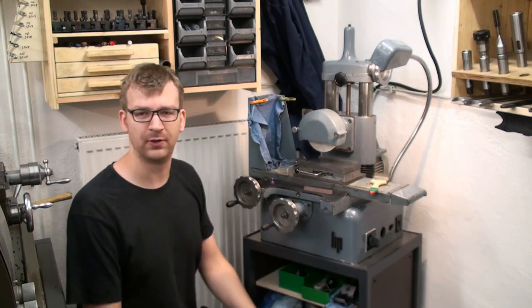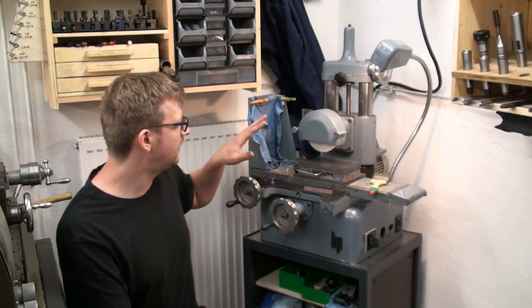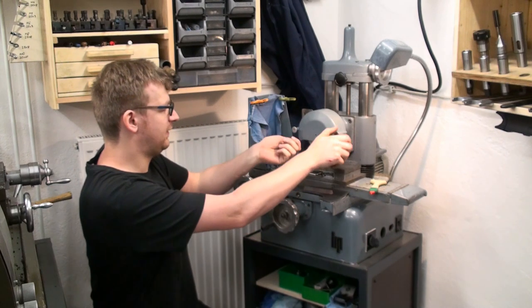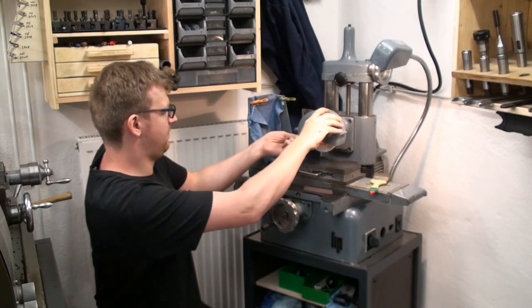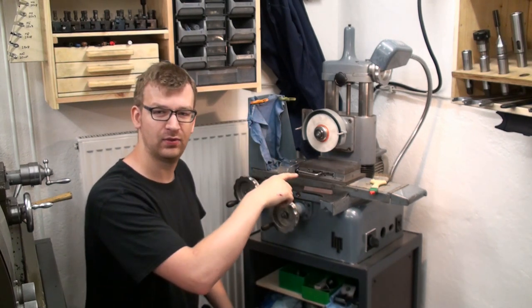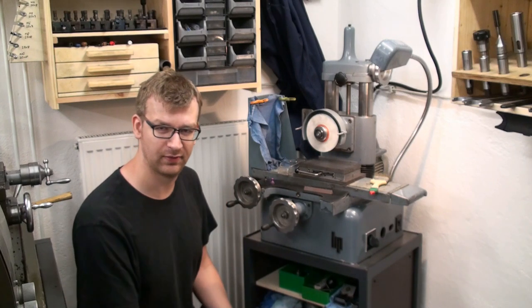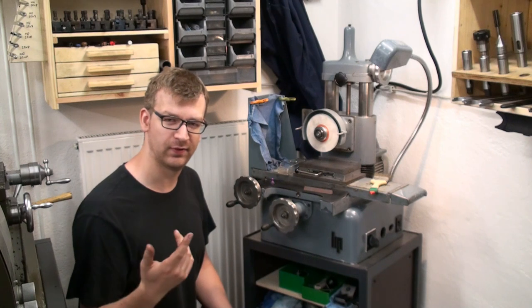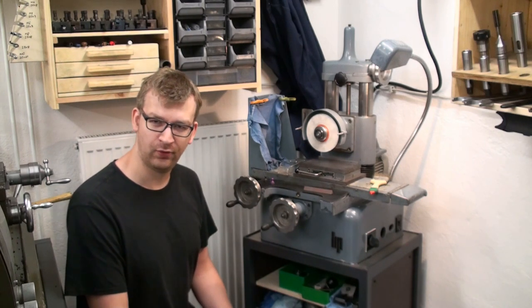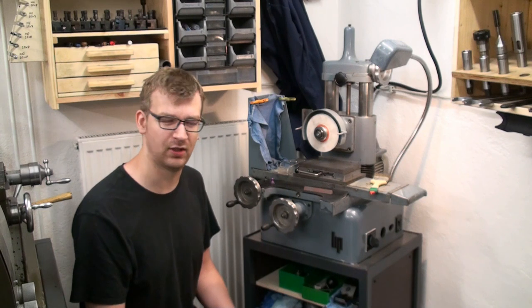So it's not a very big grinder, but especially for the kind of parts I wanted to make, it's a very handy size. And being a horizontal spindle machine, it's more versatile than a Blanchard grinder, because I can take off my wheel cover and put on a cup wheel and side wheel with it also. So I can also grind slots or steps into parts. And it also doubles as a tool and cutter grinder for lathe tooling, for example. If I have to grind a very precise form tool, this will come in handy. I'm going to build a radius dresser for it and an angle dresser, maybe even a sine angle dresser. There are pretty neat designs out there that I might copy.